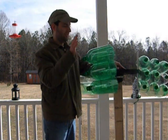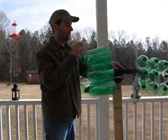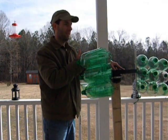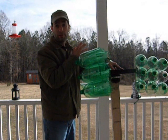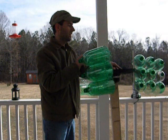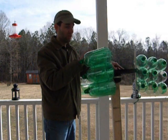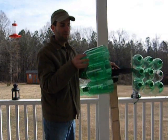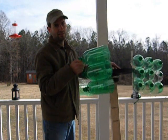It's just unfortunate that with these blades and this motor, it didn't work very well at all. The other turbine that I made actually got one volt out of it at around 20 miles an hour, so that one worked way better. But I'm going to keep on making different designs and trying different things, hopefully finding a magic combination of a free blade that works really well — good speed, pretty durable. And even if one gets destroyed or breaks, it's just a 2-liter bottle. You can easily replace it.